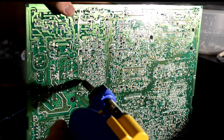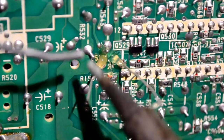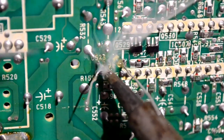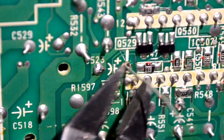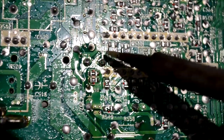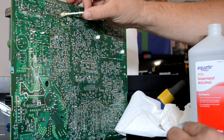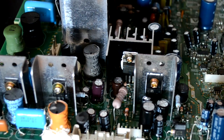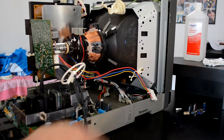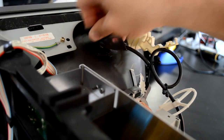I've got my main board pulled and I'm going to start removing the old capacitors. These capacitors directly impact my geometry controls for the screen — in order to get the best geometry I'll replace all these geometry capacitors. After completing the capacitor replacement, I'm going to clean all the remaining flux residue off the board using some isopropyl alcohol, then inspect my work to double-check I haven't put any capacitors in the wrong direction or used the wrong value in any spot.